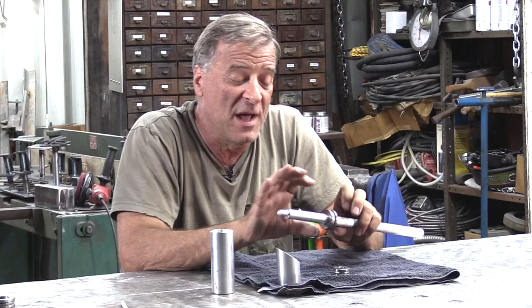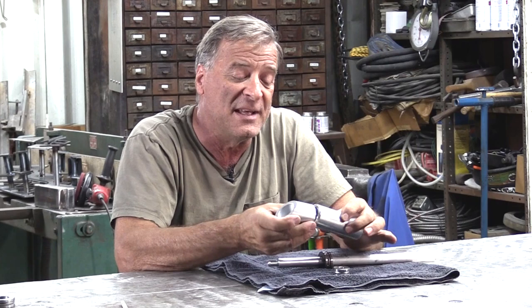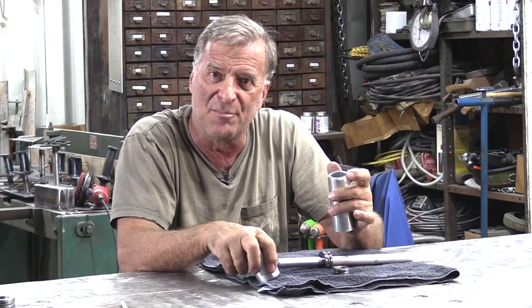The really nice thing with this setup is you don't have to weld the bearings or the races on — you can't, because these are steel races on an aluminum shaft. So that's why I set it up this way. If you want to get real trick about it, instead of welding these two pieces together, I could have hollowed this out inside just a little bit more, cut the outside diameter down, and threaded them so they would screw together. That way you could take it all apart, unscrew this, and be able to get to that top bearing again.